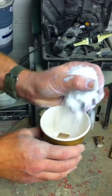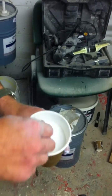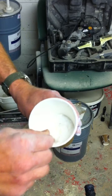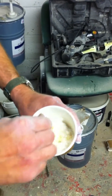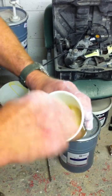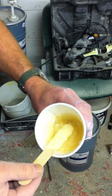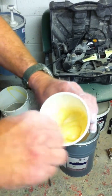Grab a handful, drop it in — note the dust and the particles that come off. You have to mix it really quite slowly and almost fold it in. It goes lumpy and horrible to start with, but eventually it will start to break down into the resin. Then you can start mixing a little bit quicker and the paste will start to form. Sometimes you end up with quite a lot of bubbles of colloidal silica in it, but generally if you add a bit more colloidal silica those will start to dissipate.